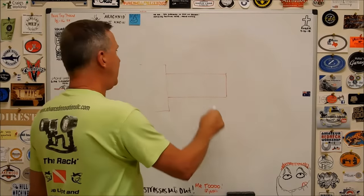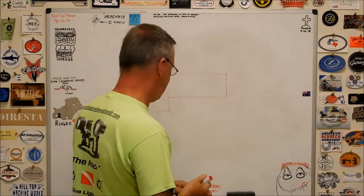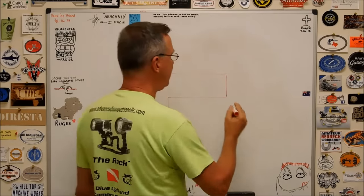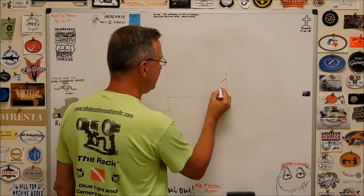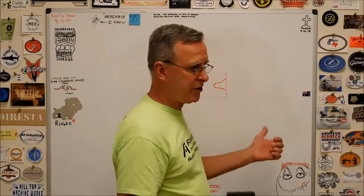All right, step number one, center drill that hole. Spot drill it, center drill it, I don't care what you do. Just start the hole. I personally use a center drill pretty much on everything. I use spot drills on a mill, I use center drills on a lathe.